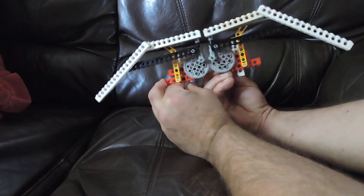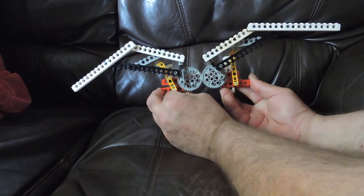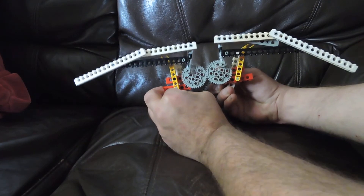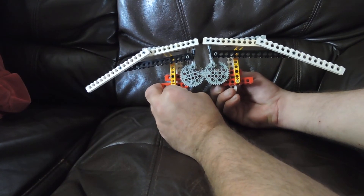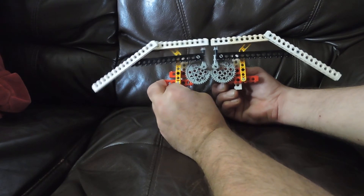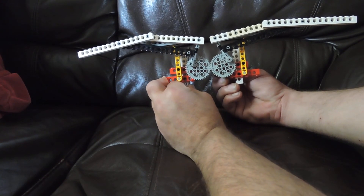This could give rise to a setup where there's one motor powering the wings and two separate motors that change the shape of the wing in flight — so for steering or just for stabilization. For instance, on a glide the wings would be out flat, and they could be adjusted for the best lift depending on the shape of the wing. That's the shape I was looking for — something like that, just adjusted slightly.